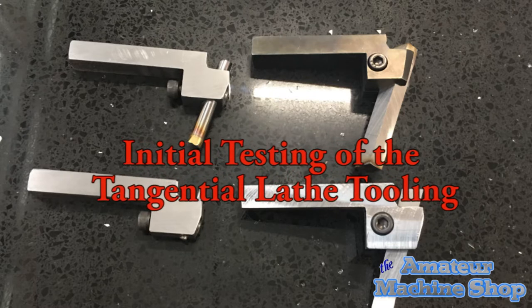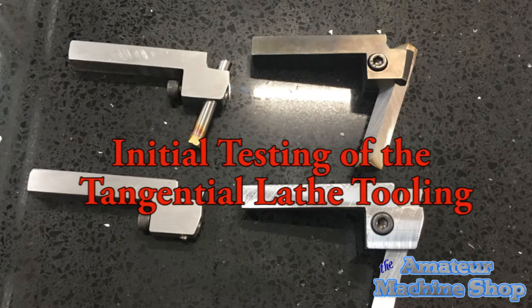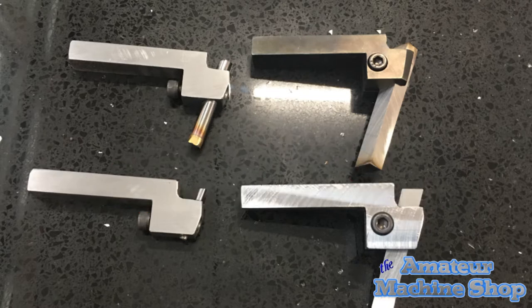A few weeks back, I made four tangential lathe tool holders. I then had to remove the fuse holder and place a circuit breaker in its place, as the little lathe couldn't handle the heavier cuts. I have broken the clips to show cuts on a 2-inch precision ground shaft and a 3/4 cold roll steel bar for each tool. The 2-inch shaft caused much vibration due to a small chuck and a light build of the lathe.